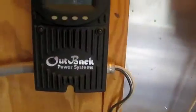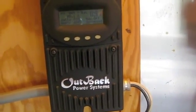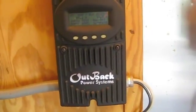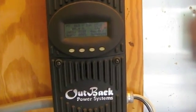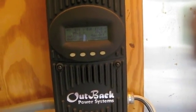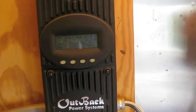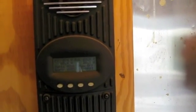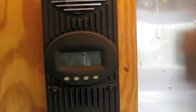Basically, we have a 500-watt array on the roof, but it's horizontally mounted, so it's not going to be peak power. It's the middle of winter, so that's probably about the best we're going to get out of it — 250 to 260. Actually, it's climbing pretty good: 290 to 300. It's an MPPT controller. We're getting up — the left-hand side is the PV input. I don't think we'll get much higher than 325 out of this array right now, but we've stabilized on the battery output. The battery is doing really good — stabilized at about 12.4, between 12.4 and 12.5. It seems to be just holding steady. No problem with a 500-watt array mounted horizontally.